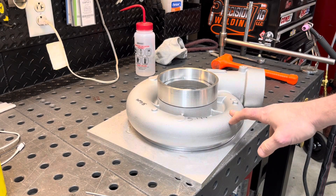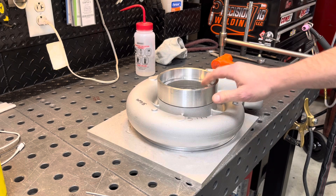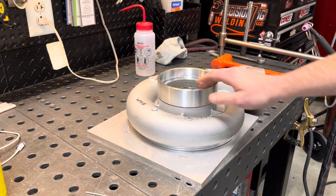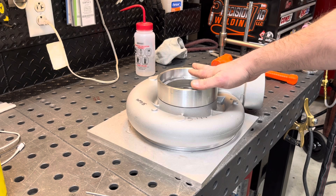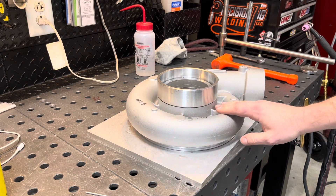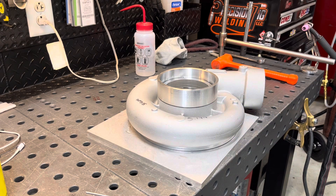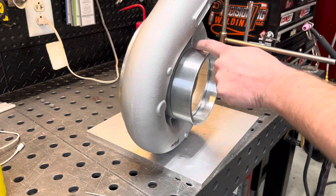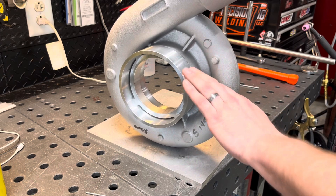This one's going to be a little different. They need this welded here — this piece slides down over the way he's machined it. The machinist asked me if I could weld around here, but he already has this pressed on, so it's going to cause some issues. Cast material is very dirty when you weld it. I'm going to clean it the best I can with acetone or non-chlorinated brake cleaner, and try to set this up and weld it kind of like a pipe weld so I can get the back side. There's a small gap, but once it's welded he's going to remachine it, so you won't really see any of this.